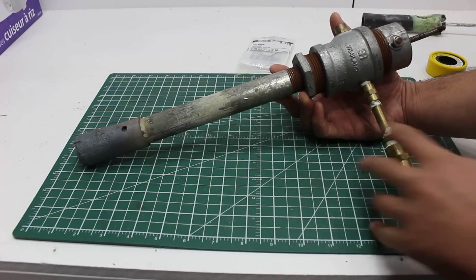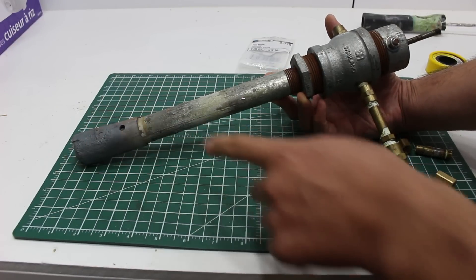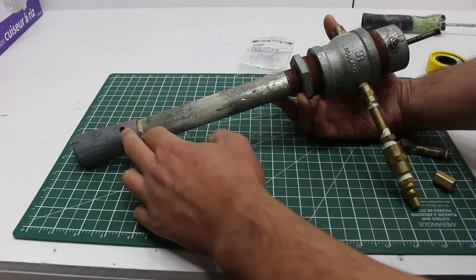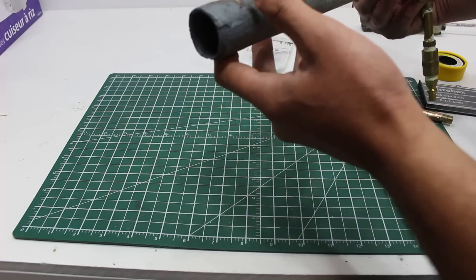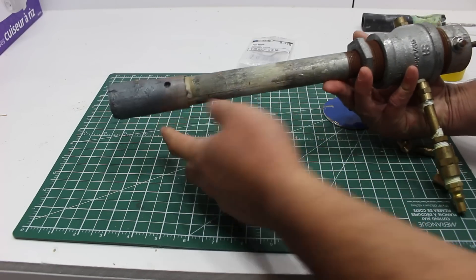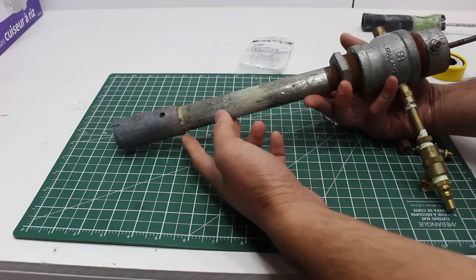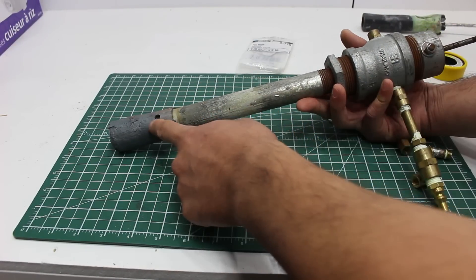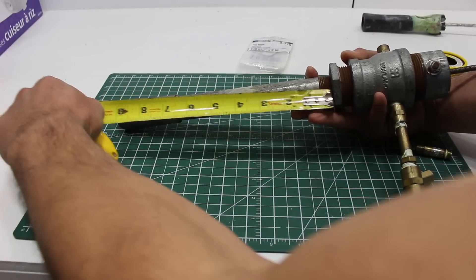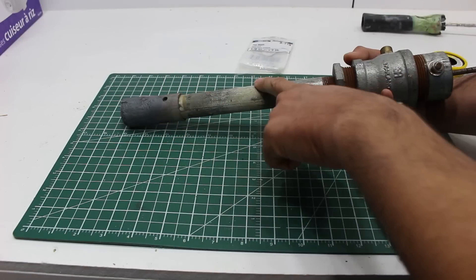First, what is this burner made out of? I have a nozzle flare here — this is made out of a piece of, I believe, one-eighth-inch metal. I heated it and bent it around to make a nozzle out of it. You could use something thinner; it would be easier to work with but won't last as long. Ideally you'd want to make this out of stainless steel, but even stainless steel will burn out over time. Then I have an eight-inch — I believe one-inch — pipe nipple.